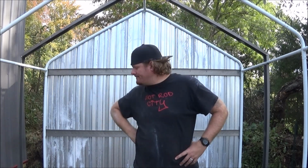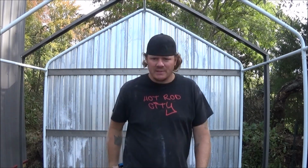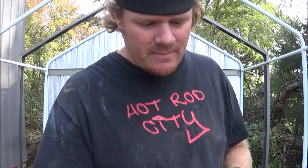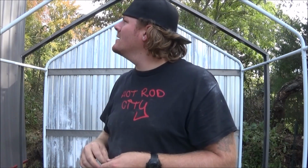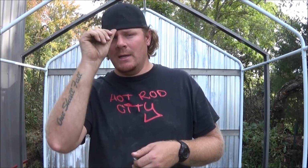So in the meantime, like I said, we got that back there. I'm not real fond of it. Those screws that I'm using, hold on a second. I'm using pretty much what I'm using for the garage. In the garage, all the panels are getting screwed to wood, so it's getting metal, so it actually has a self-tap end on it. But the problem is these studs are thin. When you're assembling them, you're supposed to be using this weird screw with a very sharp point on the end of it. And it gets wider as it gets closer to the head to really pull it in.